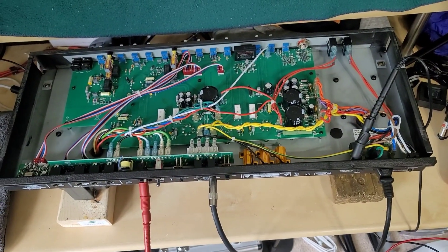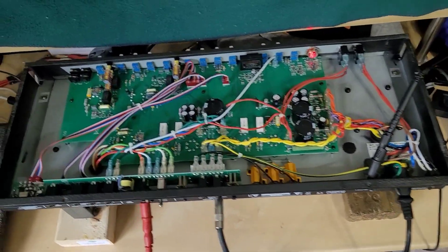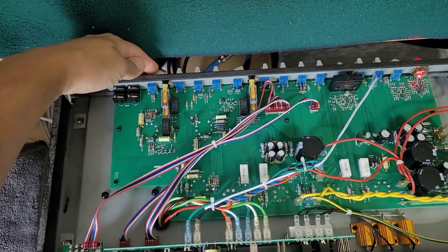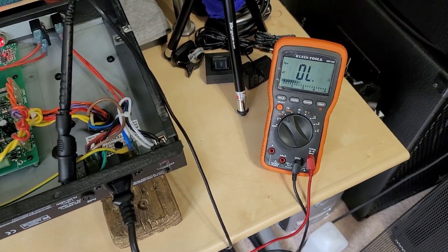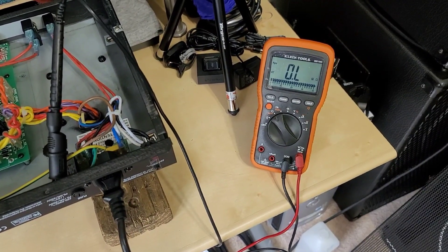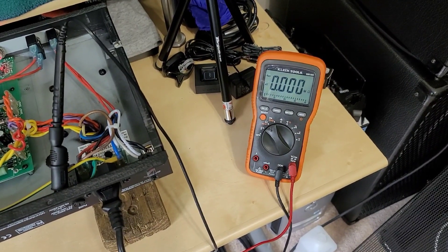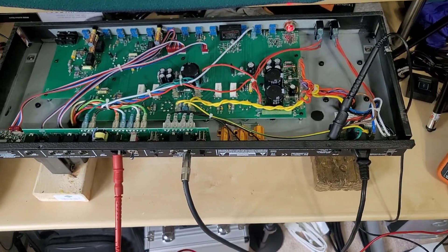I'm going to take it off standby and double-check that the noise is gone. The standby is off, we have the clean channel on. We have a low ohm potential — I press the ground lift switch and it disables pin one, which is what we want. If I re-engage it, it goes back to a low ohm potential. So that solves it.